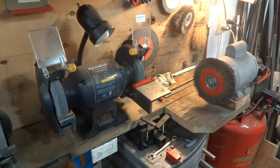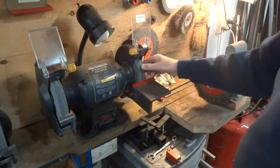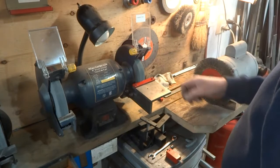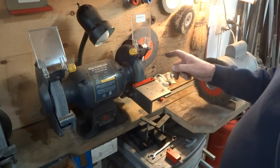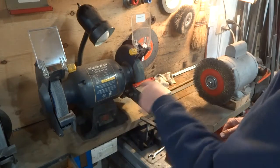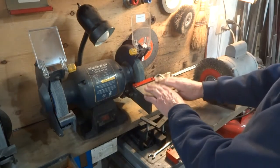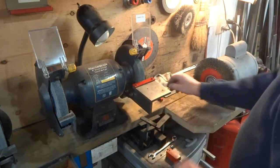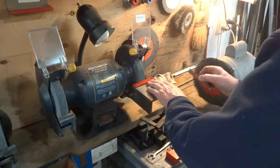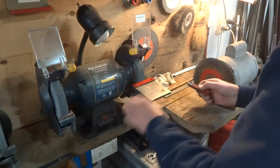It's always good to make sure that you have your grinding wheel dressed before you grind your lathe tools. This grinder used to have a rest like this one on this side, and I have made this larger one up. It gives you a lot more room to put the tool down, move it around, keeps things steady, and doesn't vibrate as much as this one did.